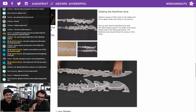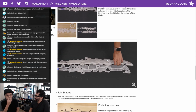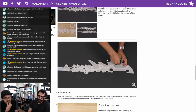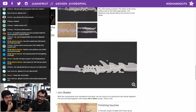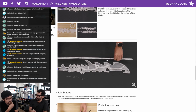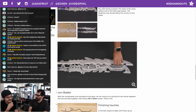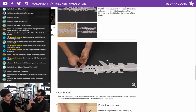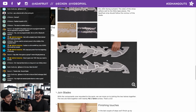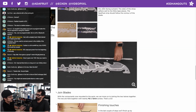So after all of that is nicely mounted, you'll need to combine both halves using M2 millimeter screws that are 12 millimeters long. I actually got the idea for building it this way when we were taking apart one of Gavin's toys, a dinosaur bubble gun. On one side of it, the standoffs were way longer than the whole part, and that gave me the idea. I was already thinking of gluing this together. It's a standard thing to do for things that are injection molded. They have these long standoffs.